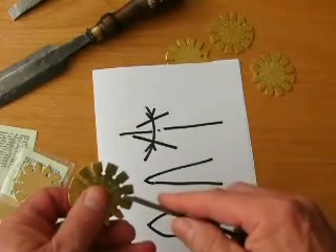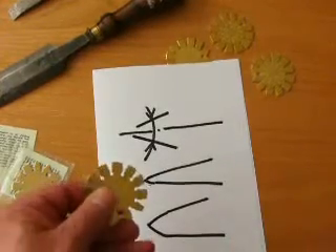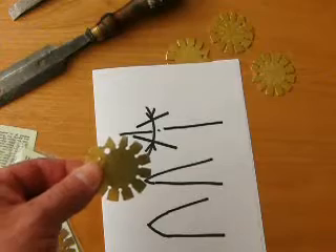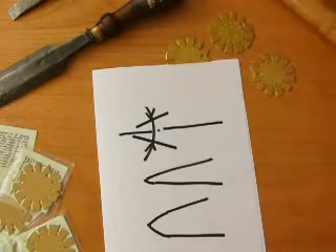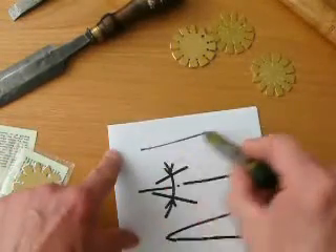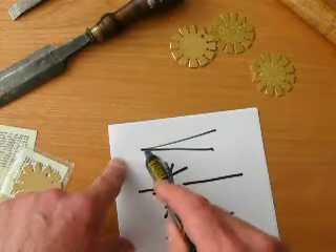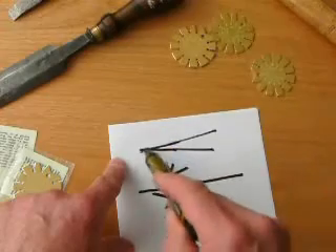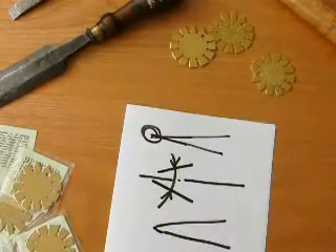It's never jammed down the aperture — that proves nothing. The little circular cutout is only for me, the tool maker. It's in the appropriate design, and it also allows me to build a stronger press tool punch. Because if we had a magnifying glass or a microscope, it would be utterly impossible to make to a feather edge. We've always got to have some sort of cutout at the end — it's an impossibly thin punch to infinity at high magnification. So we have a circular cutout at the end of it. That's the way to do it.